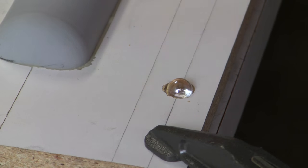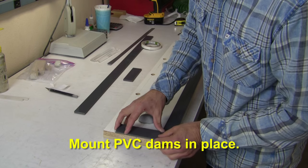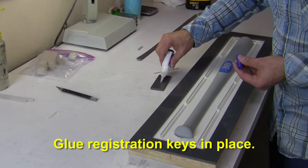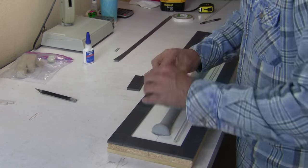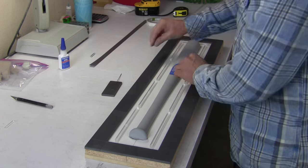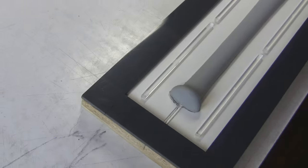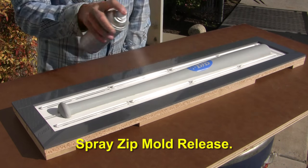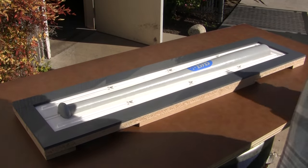We are doing this step now to avoid creating dust and debris once the silicone skin is made, and our marble drops halfway into the hole just as planned. Back to prepping the dam for the silicone skin — we double-side tape our PVC pieces to the splitter board. Once the dam is in place, we'll begin bonding down the acrylic registration keys with small drops of super glue. The sanded-down dowel vent is bonded into place as well. Before the silicone is applied, we'll spray a thin film of appropriate mold release to the pattern surface. Silicone won't bond to these surfaces, but the release will make things part easier and any texture from the spray release will be consistent on both mold halves.